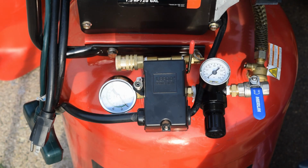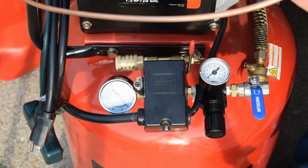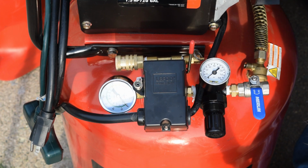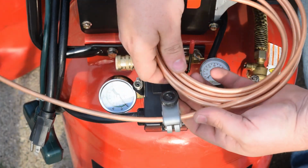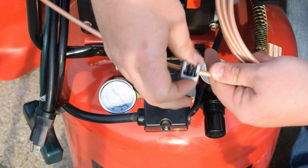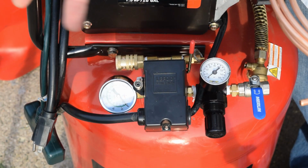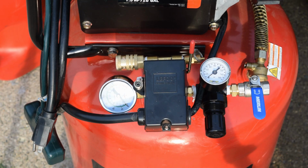I'm going to cut this piece long on purpose. So, how to use the tool correctly is you measure out your piece and simply twist this down until you get it snug. Keyword is snug. And then you're just going to go around a couple times till it frees up a little bit. And then give it another twist. Go around a little bit. It'll free up. Give it another twist. Simply just keep doing this. And then there goes the tool and the copper. Very simple, very easy. Notice, still round, so we did not force this through. That's the key to dealing with copper.